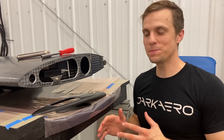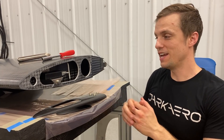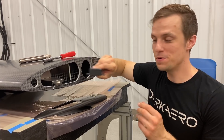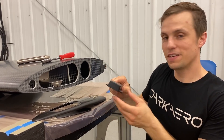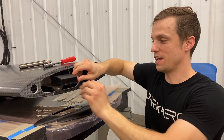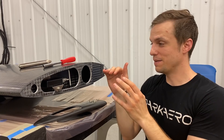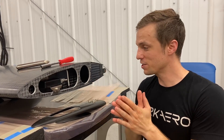In addition to the fuel system work we've also been doing some work on the wing tip areas. There are two pieces of equipment we need to install. On the left side is the GMU — the Garmin magnetometer unit. This is a little sensing element that connects with the G3X and it helps you determine your directional heading. It's a finicky little unit that requires very precise positioning in the aircraft for the yaw, roll, and pitch directions.